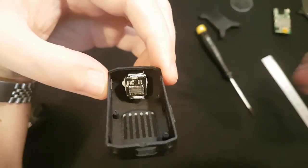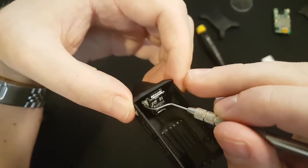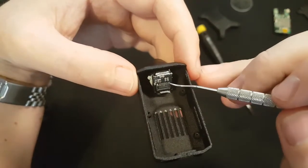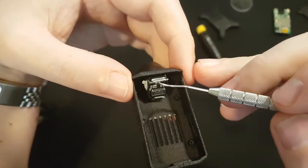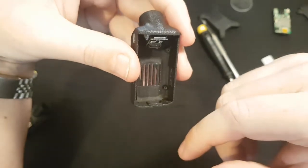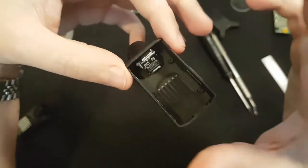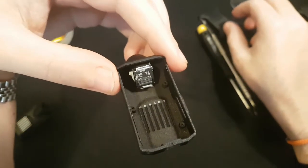Now let's talk about putting the sensor into the case itself. The sensor goes into the case — basically what you want is a little bit of silicone glue on the top and the bottom. I put some on the sides but found that's not really necessary and actually made it a little bit more difficult to get the board in place. So just a little bit at the top and bottom — all you're doing is isolating the movement and tying it into the case. The good thing about using silicone or a soft glue is that when it comes to servicing the camera later, you can simply remove the silicon thread that holds the front of the lens, push on the lens and the whole unit will pop out the back without too much resistance. It means if you break a case, want to change it around, or put your sensor unit in upside down the first time, you can pull it out and put it back together without too much drama.